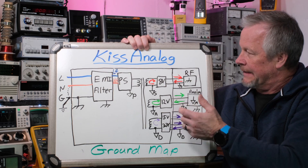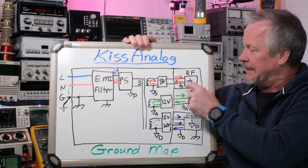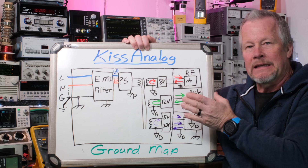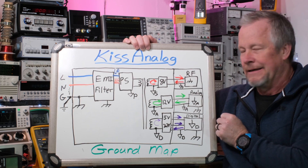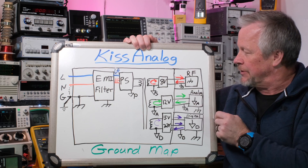The RF — I'm showing a chassis ground. Signal ground is coming over here, but the RF in that little metal box likes to have low-impedance ground, so everything likes to go straight to chassis and use the chassis as ground. That's the way it's typically done, so that's why I'm showing chassis there.